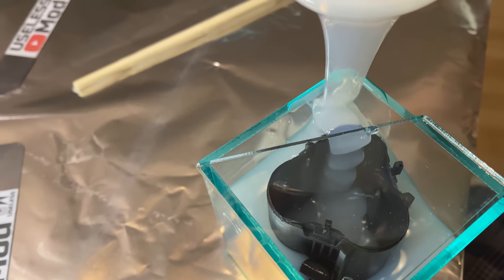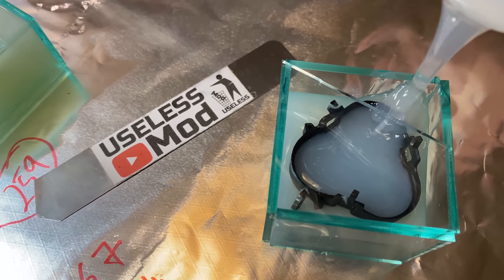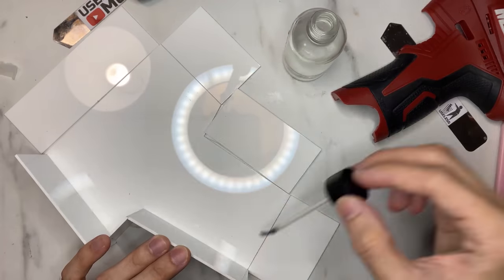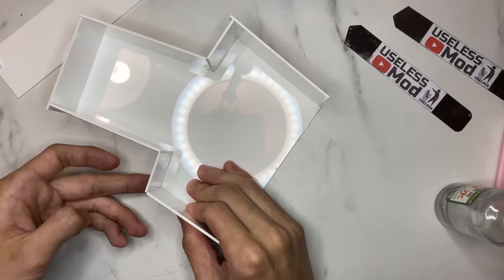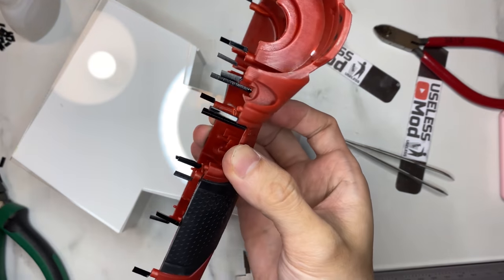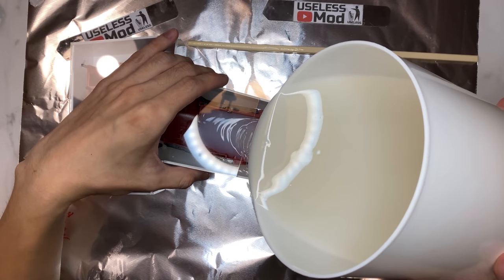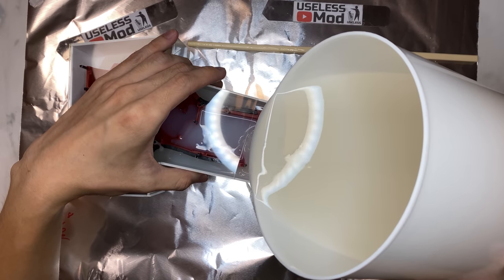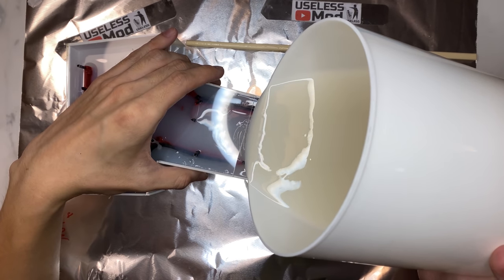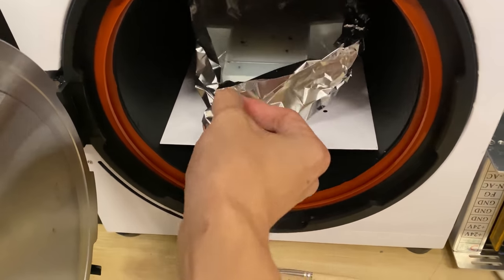The other parts are made similarly. The biggest challenge is making the mold for the case. I designed the box to save silicone, but since the shape is more complex, it required more runners. This mold used 700 grams of silicone — quite expensive. One silicone pour was unsuccessful, so in total I made three big molds.